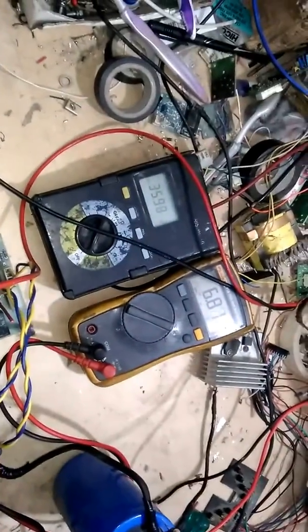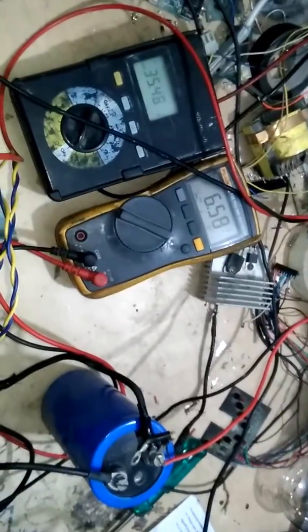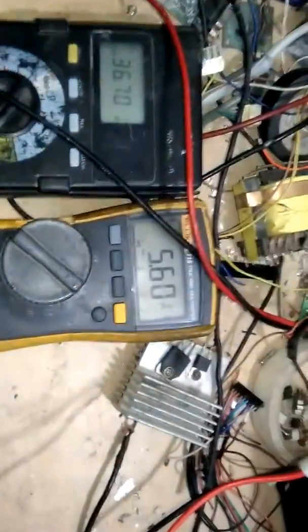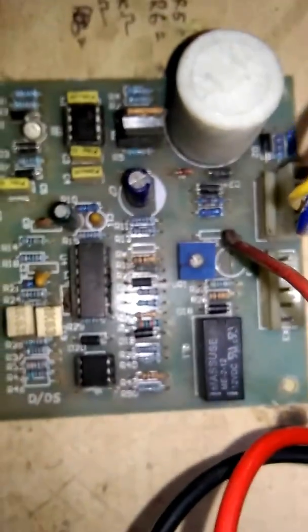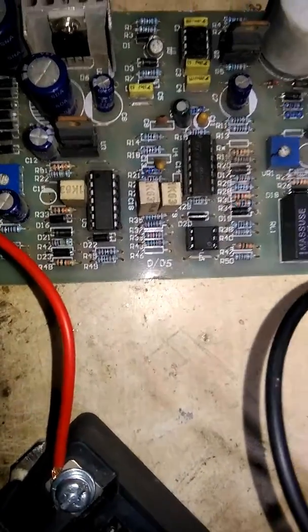You can see the AC voltage is 35 volts. We are getting nothing on the DC section — 36 volts AC is coming in from the left, but we are getting no DC output on the right. This means this card is faulty and components need to be replaced. I can see on the left side there is a 555 timer IC, in the middle an LM324, on the right a UA435, and below another LM324. I need to identify which IC is faulty. Let's check the other card.